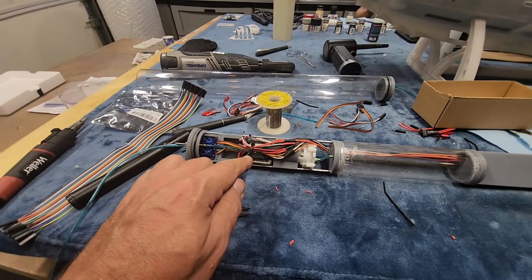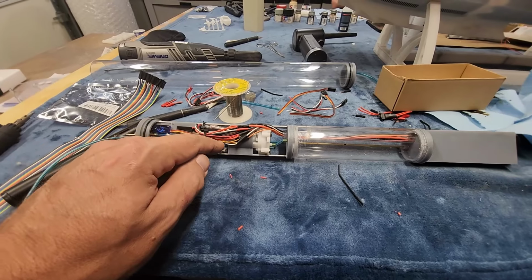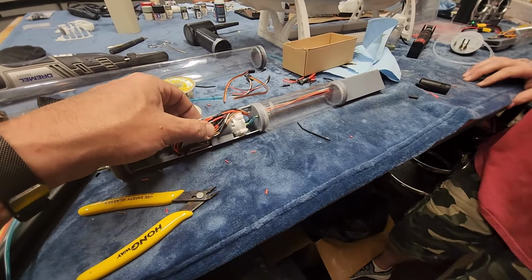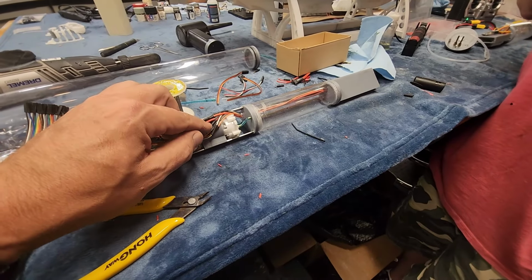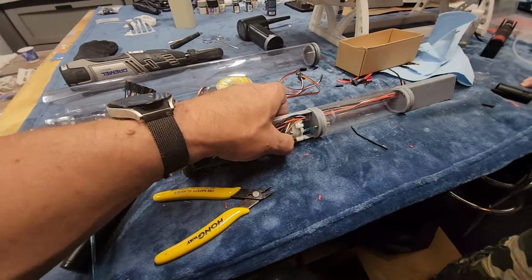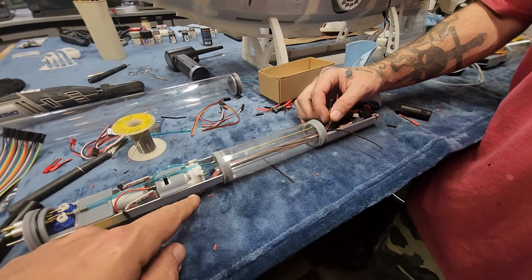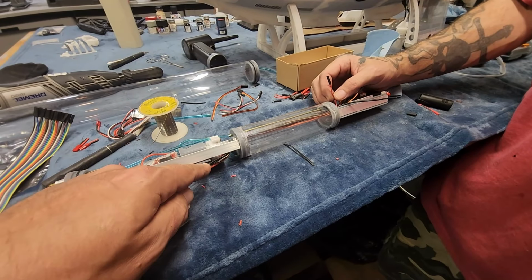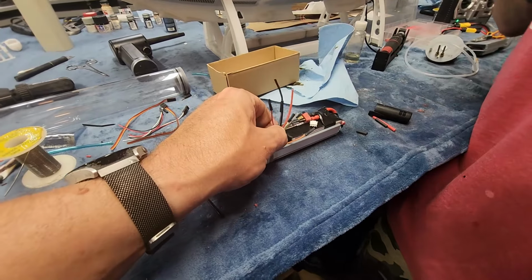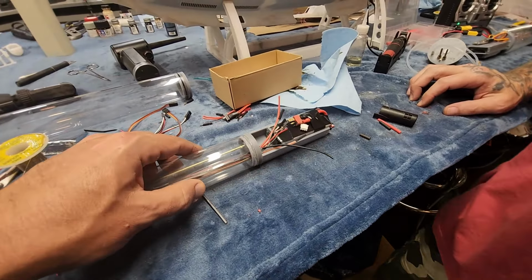So the way that we did this, all of the servos and speed controllers can share power and ground for the servo wires. And so we grouped them all together and color-coded using these ribbon connectors all the way out. So now each wire is individually color-coded, and you'll never forget which one goes to what because you can just look on the other side. So now these will just plug right into the receiver, which I've got a field underneath where the receiver is going to live.